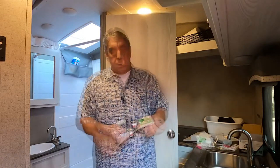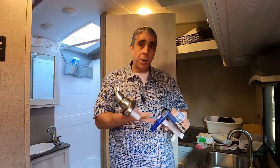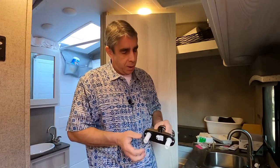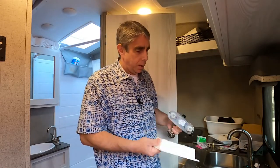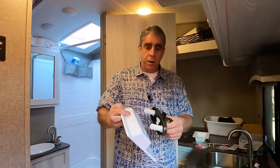I'm going to have to jam this in there and somehow create a good enough radius for the whole thing to work. I bought this online and essentially I'm going to omit the water miser feature that has the hot water supply return that returns it to the fresh water tank. So it's simple — I've got hot, cold, shower head out, so there's no bathroom faucet. This two-hole standoff is really what I should be using, but the shower surround's cutout is so large I won't be able to use it right away. The idea is to use the original standoff with the new faucet.